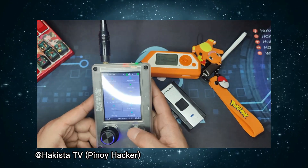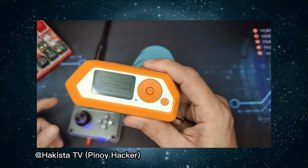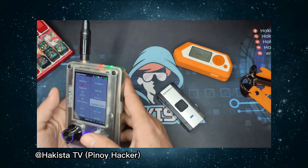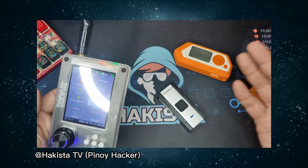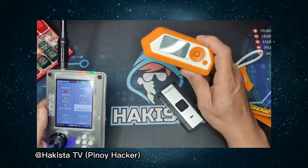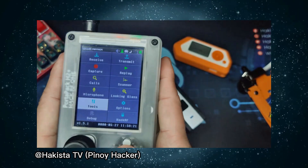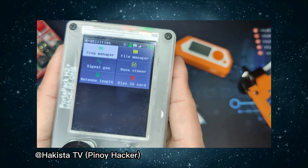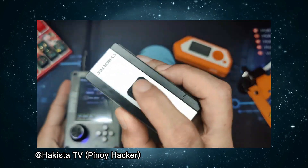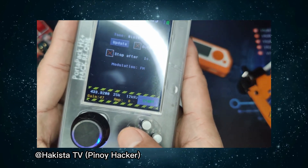With that out of the way, I will be demonstrating how it is done here on HackRF and we will be observing it using the Flipper Zero. The way it works is that the jammer will be sending a signal or signal noise to the frequency, making it impossible for the devices to use that frequency. HackRF1 under Tools with the Portapack has this signal generator, and we know that this doorbell is under 433.92 MHz frequency.